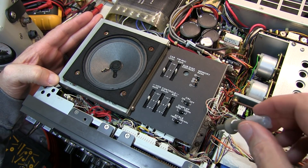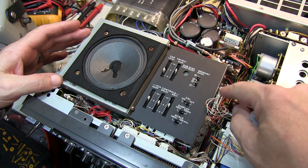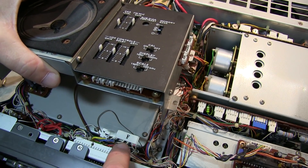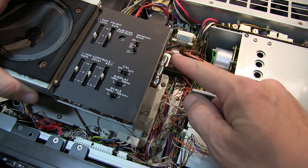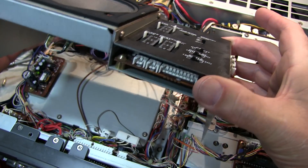There are four screws here and two on this side. Then you can remove some of the plugs with the wires and pull this out of your way. There are six plugs, all labeled F — three of them go here and the other three come off here. So you can carefully remove those and then the speaker housing can be pulled out of the way.